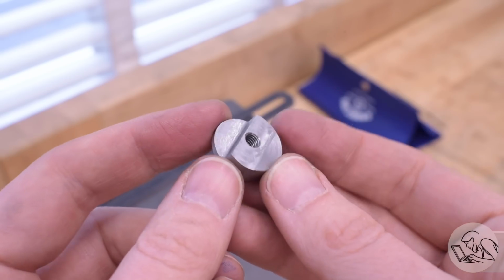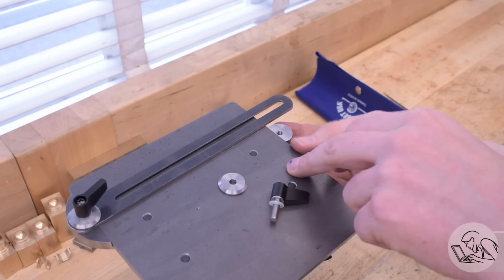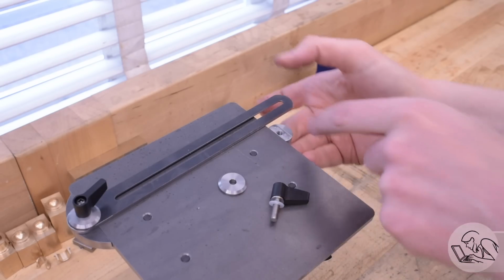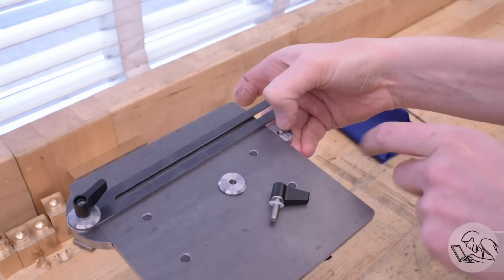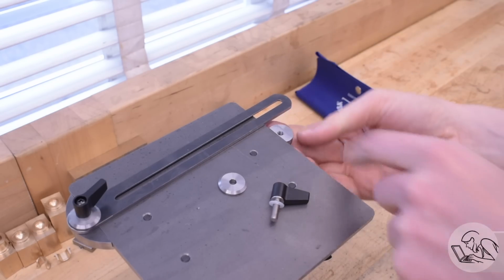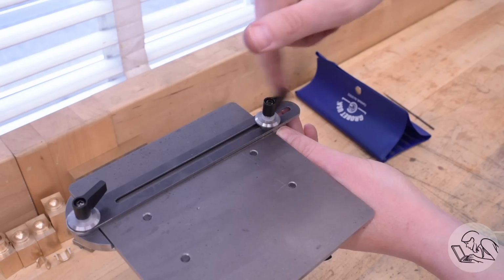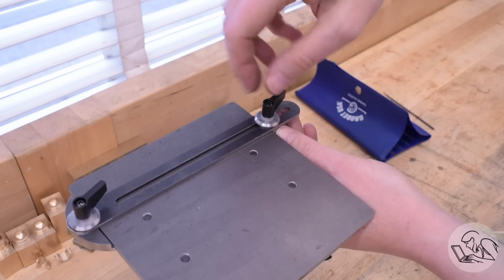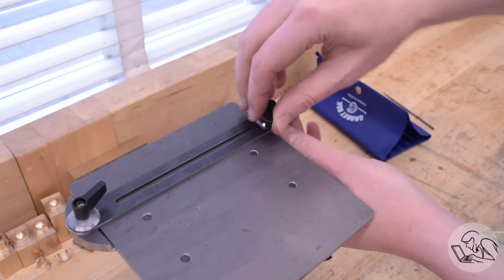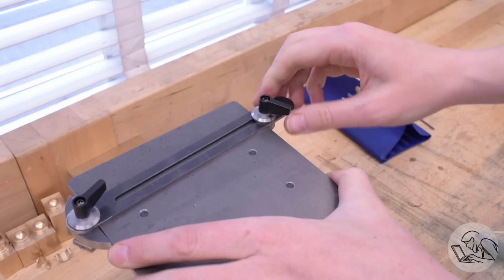I want to show you how this thing actually works because it's a great lesson in mechanical design if you're designing these kinds of things for yourself. Once again, the table is slightly proud of that clearance that we cut, and that's important so that we'll get a clamping action, which after test assembly we do indeed. Once again, the secret to a really smooth and pleasant to use clamp is having just a little bit of clamping distance between the pieces. That's beautiful. It clamps tightly but doesn't require a lot of handle motion.